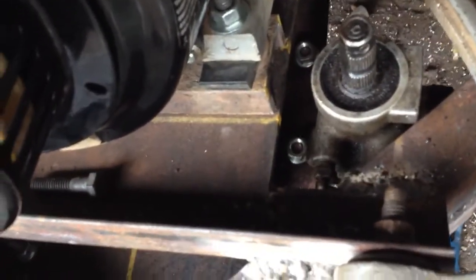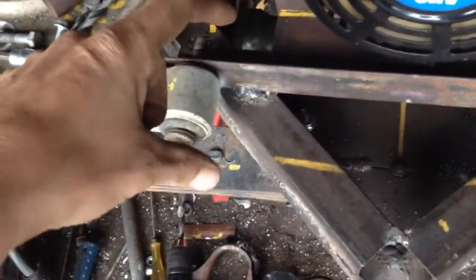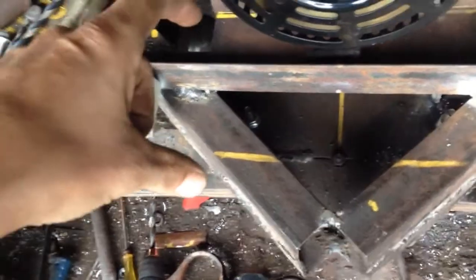So I've got these two drilled for the U-bolt, and the U-bolt is actually in there right now, only loose. I'll just leave things loose so I can mock up the other side. And the other side is right here, and I've drilled one hole there, and I measured how far back it was from the spring bracket on both sides, to try to make it nice and straight. So I got one more hole to drill here. But so far I'm really satisfied. I'm really happy with how this is working.